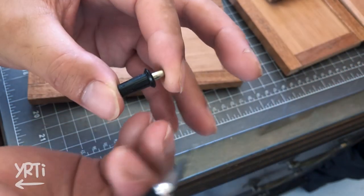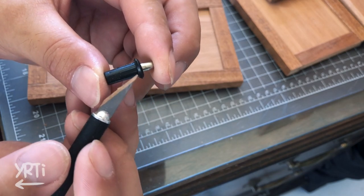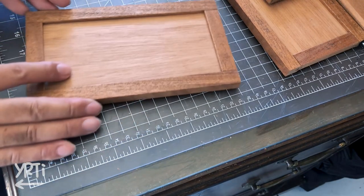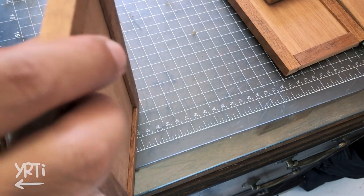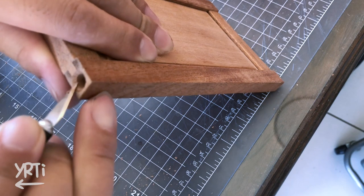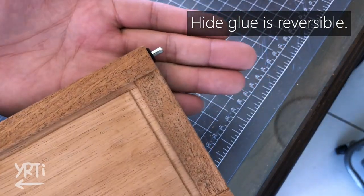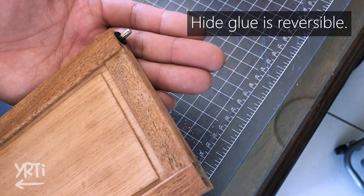Oh, and I used a spring pin as a door shaft. The neck part of the pin I got was tapered and I didn't like making a big gap between the doors and the frame. I trimmed the edges with an X-Acto knife to countersink it. I don't rely on these cheap pins, so I used hide glue to secure it.